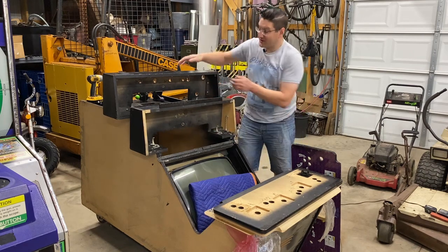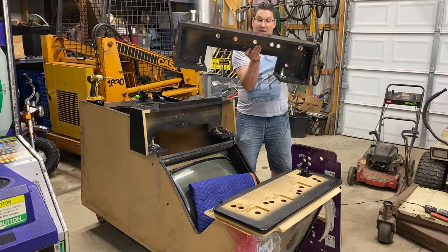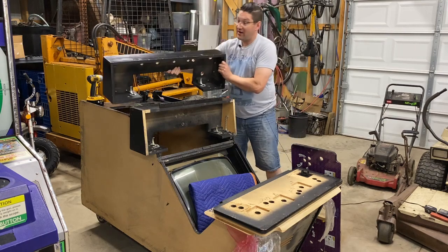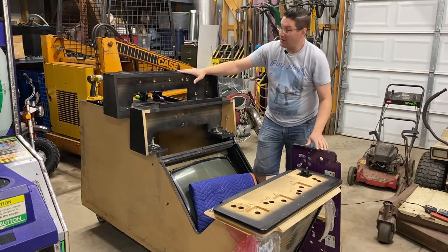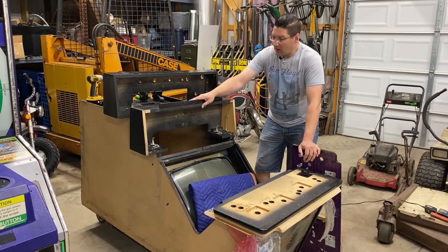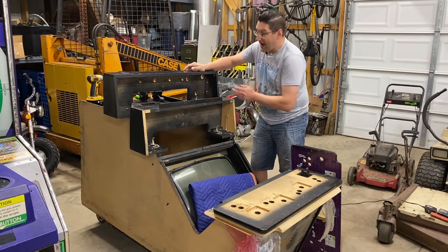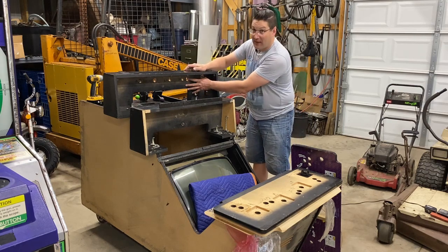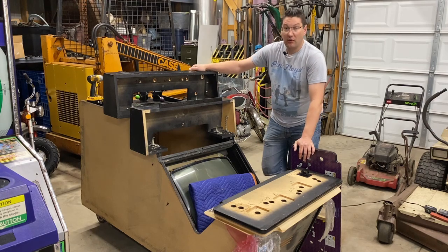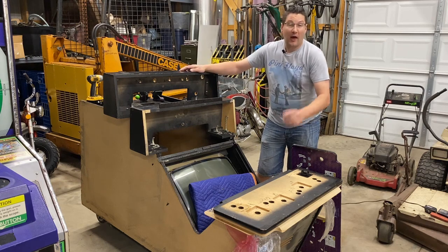Also, this one has had about, let's see, 1, 2, 3, 4, 5, 6, 7 holes drilled in the bottom. So now I've got to repair those holes, which is doable. What I'm going to do, because I've got the hardware I need, I've got the hinge on this one, I've got the outside on that, I'm actually going to knock this bottom out and make a new one. It's just a square cut piece of wood, no rabbets on it, no nothing. The rabbets are on the side. I may damage the sides removing it, so I'll have to do repair.